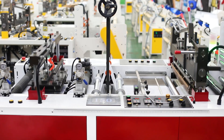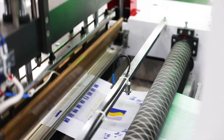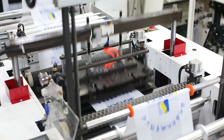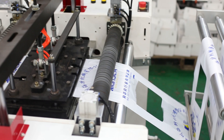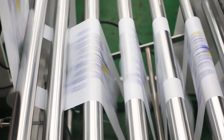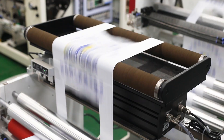Film material can be biodegradable, LDPE, and HDPE. The production procedure is that the machine unwinds the film roll first, then heat-seals two sealing lines, punches the bag handle, and rewinds the finished bags at the end. It requires manual film break and core change.